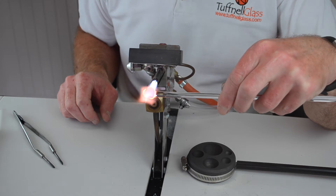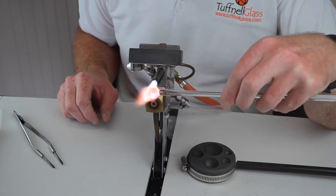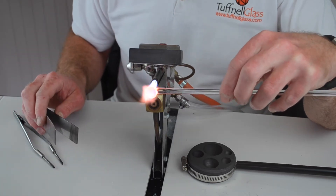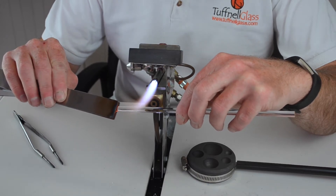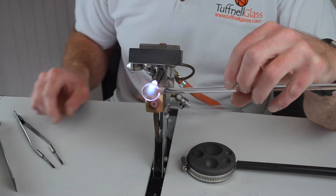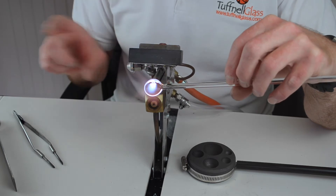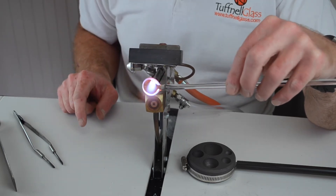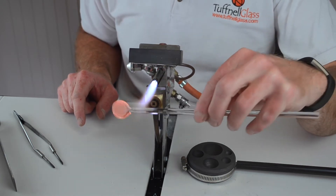As you can see, it's holding like a little lollipop shape now. I'm going to melt this up nice and hot, and with just a normal pair of mashers flatten that into a lollipop shape. As you always do when you use tools, just flame polish the shrinkage marks off. You get little fingerprint shrink marks from the tools — less from graphite and carbon than brass — so just flame polish those off to give it a nice finish.